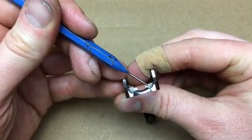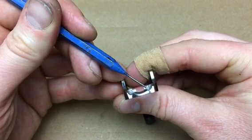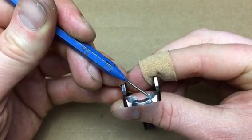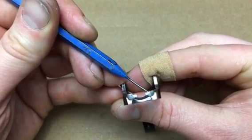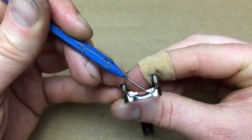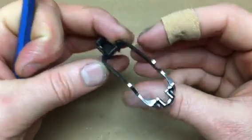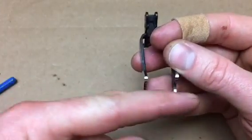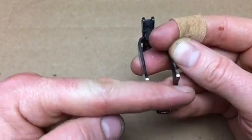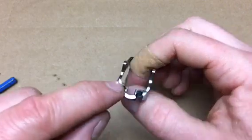Other places to note, all of the surfaces across the back here, particularly the spot where the tip of my punch is right now, is the spot that the bolo disconnector on my gun uses. This is what's pushing the hammer back, and then it gets cammed downward and the disconnector slides off the top and the hammer snaps forward and the gun fires. This is the primary operating surface in double action right here. Same thing for along the top edges right here and here. Everything that's basically on the top edge of the gun right here, I want to look like a wet mirror. All these little surfaces back here, I polish the hell out of.